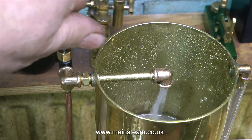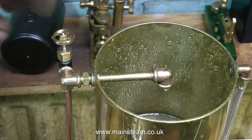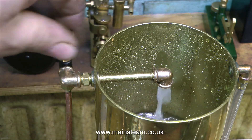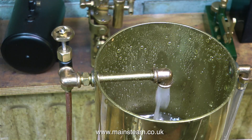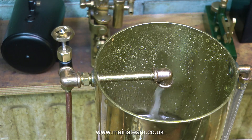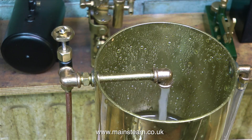I think at a future date this pump is a candidate for a complete rebuild — a ground up rebuild on the water side. The steam side is fine, no problems at all. It's just the water and the silicone rubber issue. With this type of valve — the mushroom type poppet valves — it's not like a ball valve; they will generally be quite forgiving and let particles through. But if any particle of silicone rubber, however small, lodges between the valve face and the mating face on the block, then it's going to let water through and it's not going to get any better.